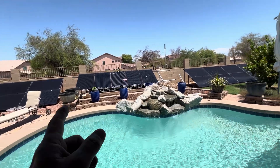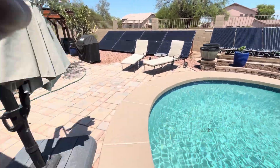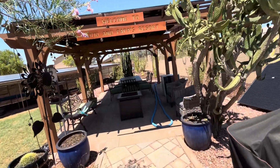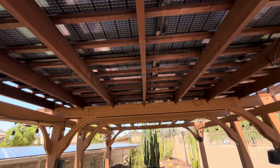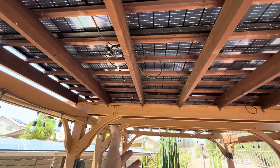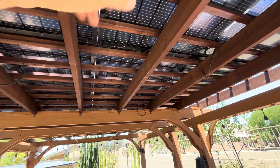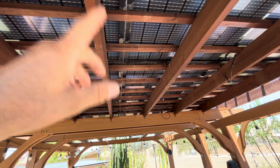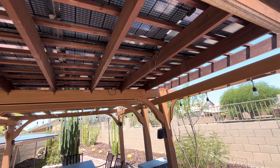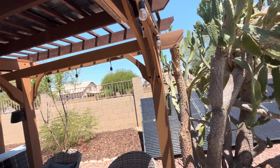I'll leave links in the description for these used solar panels. My favorite are the new ones from Signature Solar — they cost more but come with a long warranty. You can see the light through them — these are bifacial, so they pick up light from underneath. That's extra circuitry to gain up to 100 extra watts per panel. I got 10 of those 400-watt bifacial panels with a potential gain up to 500 watts each, and they're doing really well.